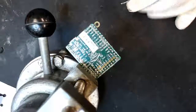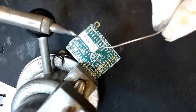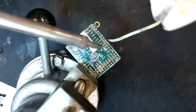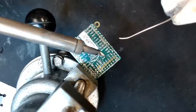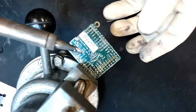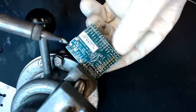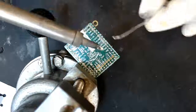If you are using a temperature-controlled soldering iron, I would suggest you use something around 330 degrees. The idea is to apply solder along the connector slowly without any pressure — do not press on with the tip of the soldering iron. Make sure you're wearing gloves to prevent burning your fingers, and try to wiggle it gently, either with your hand or with a set of pliers.